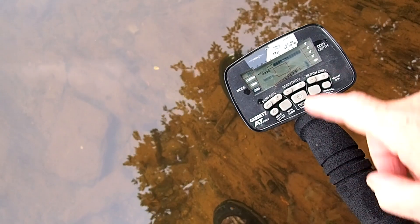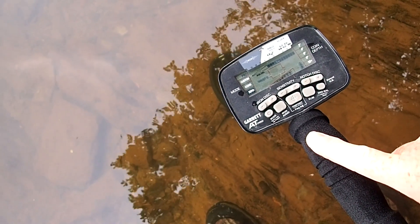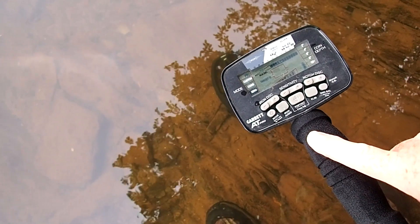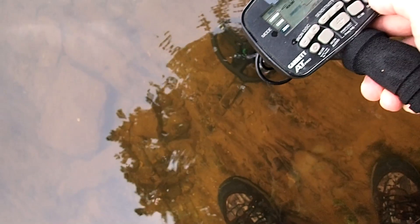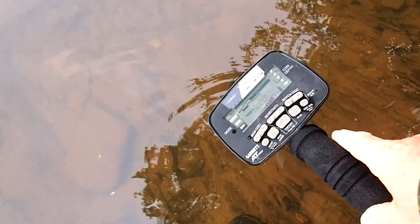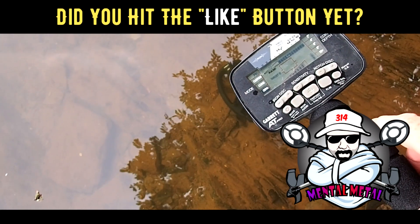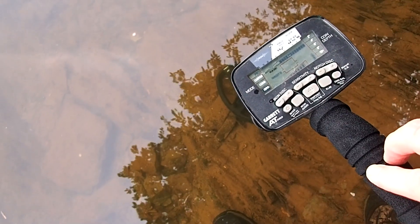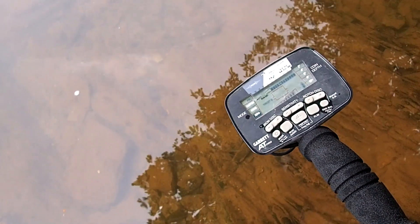And the iron audio — you can turn that on and off if you want. I always like to leave it on; I like to hear my targets. That is really simple. This is one of the easiest machines you can ever own and operate, on land or in the river. If you want to ground balance it, you still can — you should be fine in the water though. If you want to, just hold in your ground balance button and bob it up and down even in the water until it gets quiet. You usually don't have to, but you can. That is all there is to setting up your AT Pro or AT Gold. The AT Max is a little bit different but pretty similar. These machines have worked really well for me over the years and they'll work good for you too.